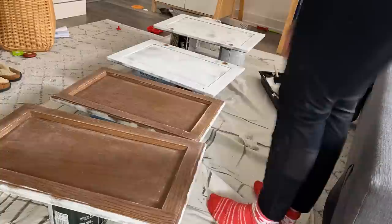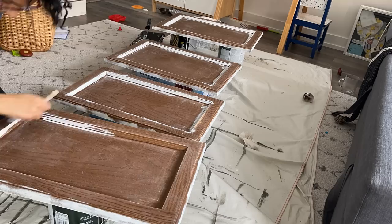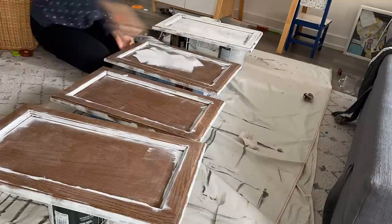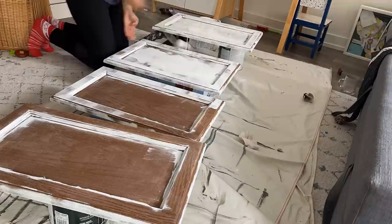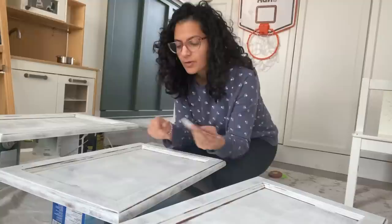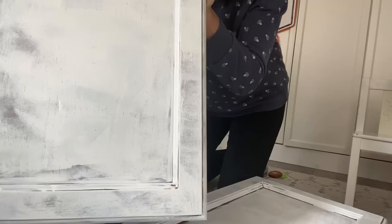You need a really good primer to make sure it will adhere to the boards. I've listed a few of my favorites in the description below. I used them all to paint furniture and cabinets before. When priming your cabinet doors, use a foam brush and a foam roller. First go in with your foam brush and paint all the little crevices, any shaker details, the edging — anything your foam roller can't reach. Then go ahead with your foam roller and paint the entire cabinet door. You want really good coverage. I usually do one coat of primer, but make sure you cover the entire cabinet door.